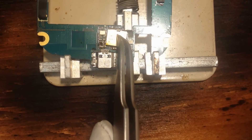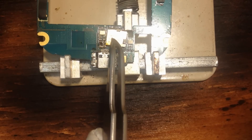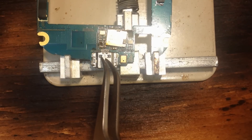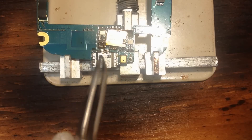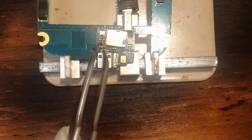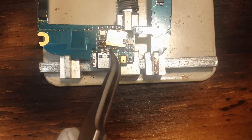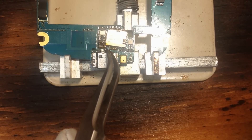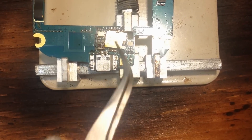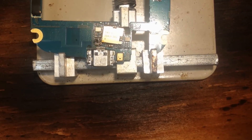When you put your board in your board holder, make sure it's not pushing against any components — that's what happened here. This piece was pushing against this piece which is soldered on, and I just pushed it out of place. When you first heat it up, make sure that it's hot — everything. Because if you pull and the solder is not melted completely in the back, you can easily rip off the connector, and you don't want to deal with that. So make sure it's hot enough, keep the heat on it. Wear a glove so you don't burn your hand — that makes life a lot nicer.